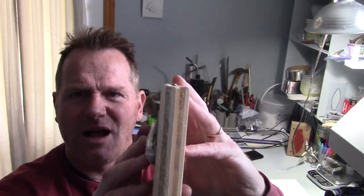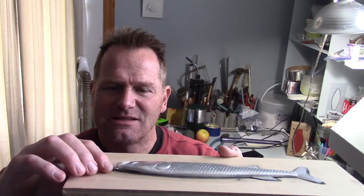Okay, so. Something else I'm gonna show you guys too is when I get this thing in there, I'm really not exactly half. I'll leave these eyelets completely touching this surface, but completely above that surface. That puts my parting line on one side of the eyelet. When I insert my eyelet into that rubber, it's completely engulfed, just open on the side it's touching, so it holds your eyelets in place real well. Sometimes I'll add weight to my eyelet, and if it's too much weight, I can make a little tiny staple out of wire and pin that eyelet in place too.